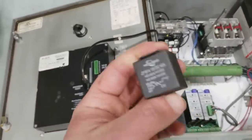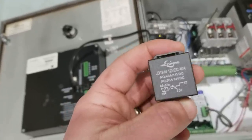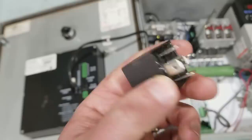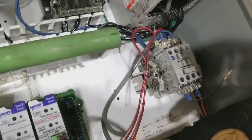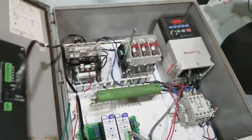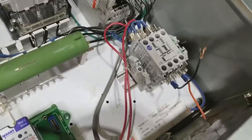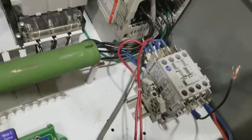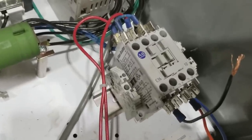We've learned thus far, boldly into the unknown, that these Chinesium 12-volt DC relays will not chooch at 200 and some odd volts DC. So, we're looking at a motor contactor. We're going through the boneyard here. This is why you can never throw anything away, ever. We have a motor contactor. That's our safety. The ever intrepid Dewclaw figured we could convert this to digital.